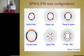But these are short of full pitch, and it allows the core to extend out to the OD of the magnets. This gives it saliency. This is like a switch reluctance pole that you have here. So you're going to get a torque from the magnet, and you're going to get a torque produced from the saliency of these steel poles.